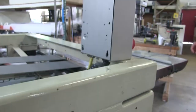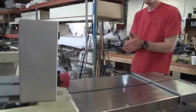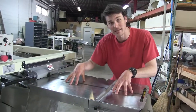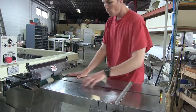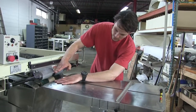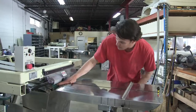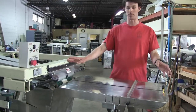Let's move on to the other problem — your shirts. Shirts being pulled in or going in at an angle. Hopefully, if you do what I just told you — level the table and level your shaft and rollers according to that table — I'm hoping that will fix everything. Normally when a shirt gets pulled to one side, that means the shaft is sitting at an angle, so the green belts pull that shirt in before the right side and it turns. Once we've leveled everything out, this should be the fix to all your problems.